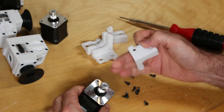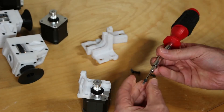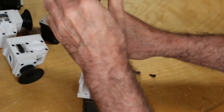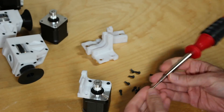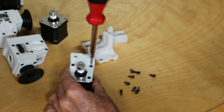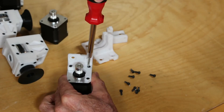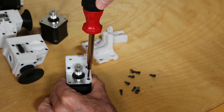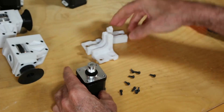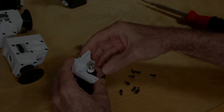Now we'll install the Z-drive motor mounts. For this you'll need the four Z-drive motors and the 3D-printed mounts. That thin edge will be directly opposite the socket on the stepper motor — use that for alignment. Be careful to get the wiring orientation correct, otherwise you'll have to disassemble these later. Hand-tighten these so they're firm but not extra tight — I actually broke a pair of motor mounts by making them too tight. Repeat this for all four motors. Thanks for watching — please hit like and subscribe, and stay tuned for the next installment where we will assemble the base.